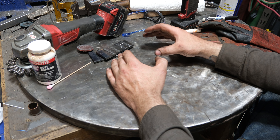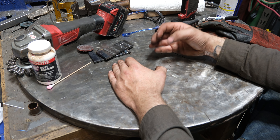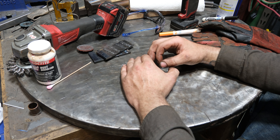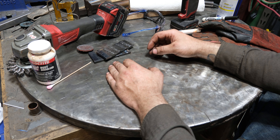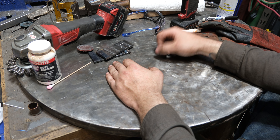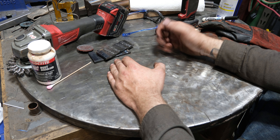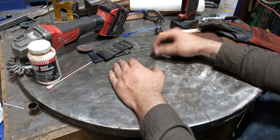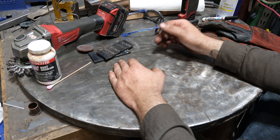7014 and 7024 can also run on AC. Technically most rods will weld on DCEN, but you'll see the same results as in this video — loss of penetration and a high ropey bead profile with little benefit. The reason 6013 and to a certain extent 7014 are sometimes run on electrode negative is that with the little 1/16th sparkler rods, it can help you weld auto body sheet metal without blowing holes. It's still not easy — it still sucks — but it can help. You wouldn't use 7018 or 6010 for auto body.